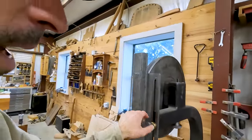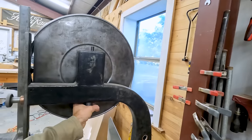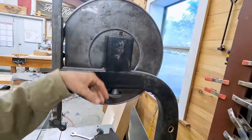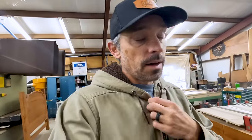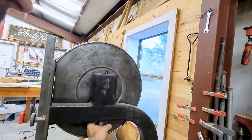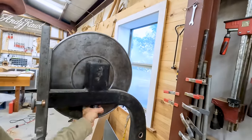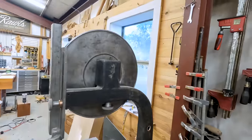I originally reached out to them because the spring on this tensioner was broken. If you remember, when we took this thing apart, the only broken part on the machine was the tensioning spring — it was just in pieces so you couldn't tension it. All I had to do was send them an email with some pictures. I pieced together the broken spring, got some measurements, and they pulled a spring that fit perfectly and replaced it. It's in there now and works great. At first I thought it was going to be too stiff — we had to clamp it to pull it down — but with that thrust bearing in there it just turns real nice.